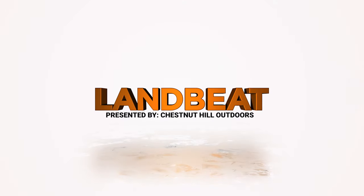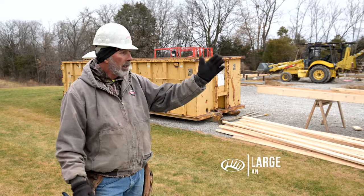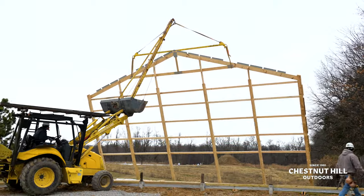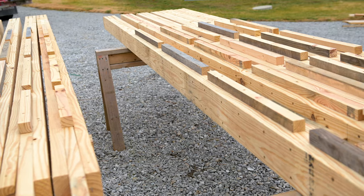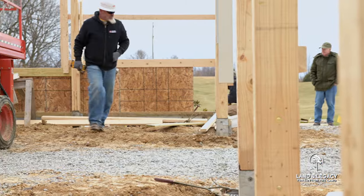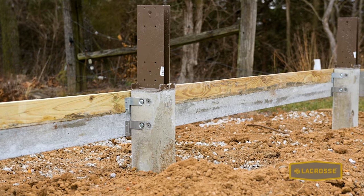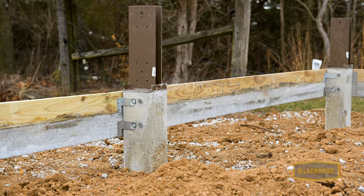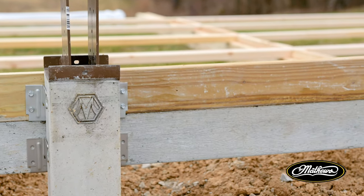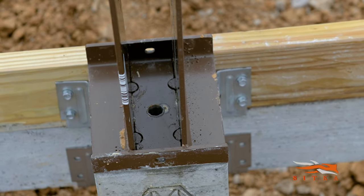There are some exclusive things Morton does. This building is prepped in our manufacturing plant — the columns are pre-made for us, machine-stressed and machine-pressed, held together so everything is within millimeters of being exactly the same, versus somebody having to come out here and cut it, where each cut is different. Our concrete columns are Morton exclusive and adjustable in height — when we dig the hole, there is a threaded rod on the very bottom that allows us to adjust them up and down.